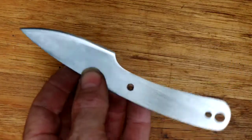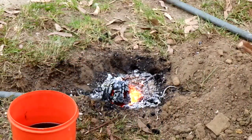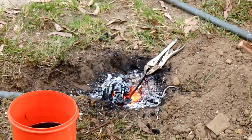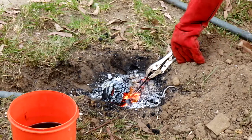As you can see, I've figured it out. I think I saw a video of Dave Canterbury doing a pit forge — or trench forge, I think he called it. All I did was dig a bit of a hole, stick a bit of metal pipe in there, threw some coals on top — some charcoal I had from a barbecue — hooked up the air compressor turned down to about 20 psi and let it rip. It seemed to work a treat. I don't know if I actually heat treated this thing properly, but it did get red hot and when I put a magnet to it, it wasn't sticking, so I think I got it hot enough.